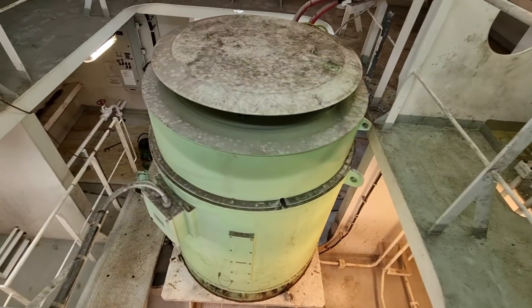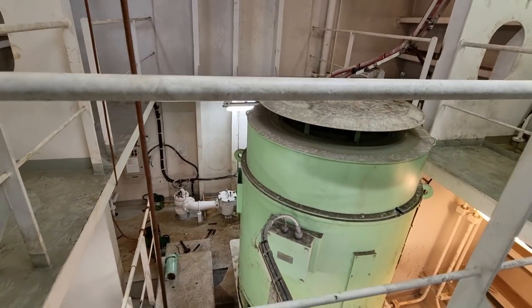Just like I keep saying in my previous videos, there's a reason why these things happen and we need to find out why. The first thing I will do is check the bow thruster motor to make sure everything is okay there, because I don't want to do the isolation of the main switchboard only to find out there's a problem on the bow thruster motor side. Here's the bow thruster motor - there are no signs of damage and all the fittings and terminal box are okay.